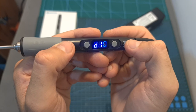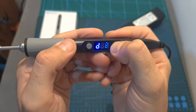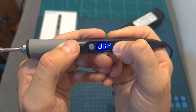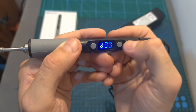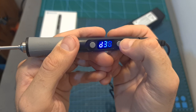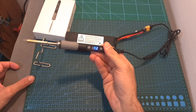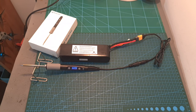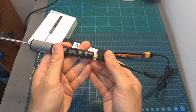The first option, which is by default set to 10 minutes, is the sleep timer. You can set it to between 1 to 30 minutes, and in case you are not going to move the soldering iron for this set amount of time it's going to enter sleep mode and the temperature is going to be set to 100 degrees Celsius. After entering sleep mode you have five minutes to resume normal operation by shaking the soldering iron, otherwise it is going to automatically shut down and you will need to reconnect the power supply in order to use it again.